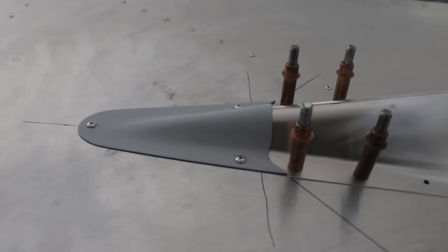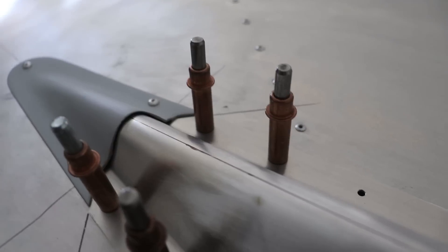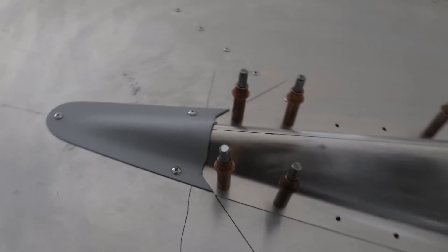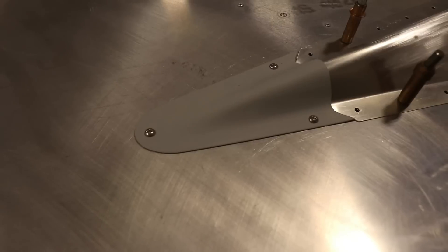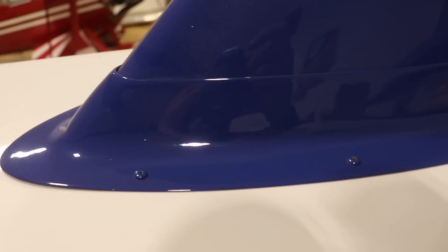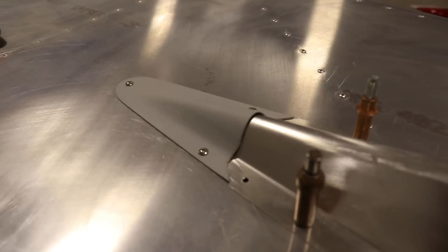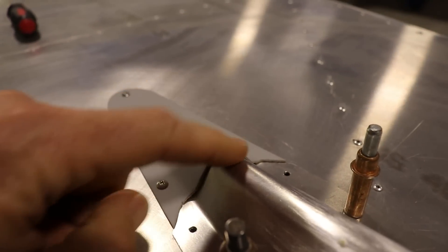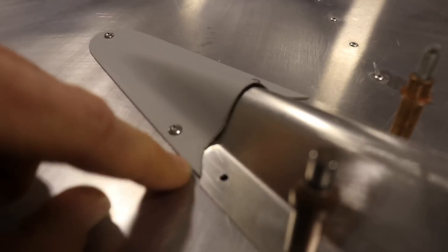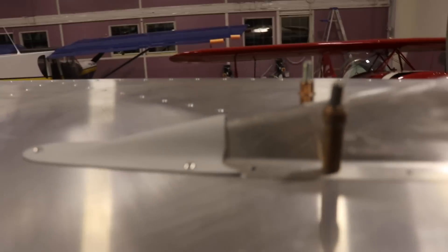There was one more step I didn't film — I spread resin and micro balloons on the fiberglass to smooth it out over at my neighbor Len's house because he had the fiberglass resin. I sanded that, then sprayed it with a sandable filler primer. I've attached this fairing the same way I've attached fairings on my cruiser — just with little sheet metal screws. But because of using four layers instead of two or three, it doesn't fit perfectly. There's a little tiny gap in the back, and part of the reason is I need to trim it a bit more since it's sitting on top.